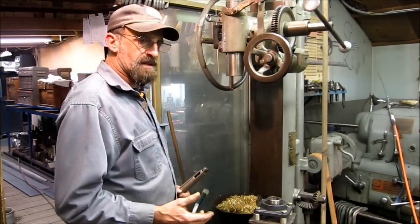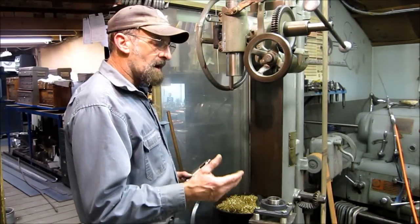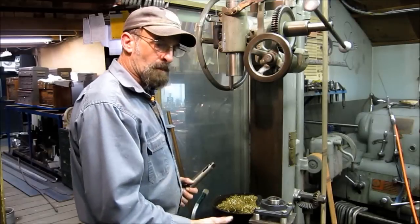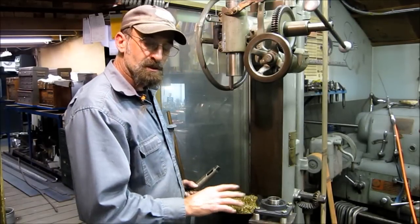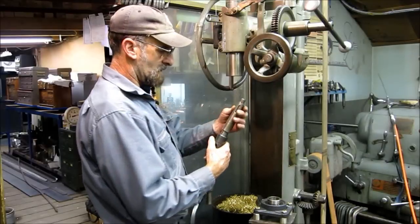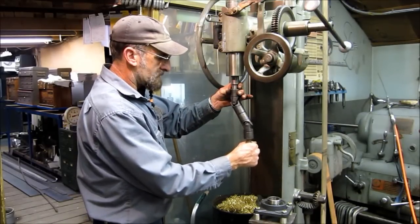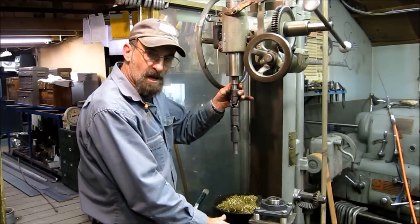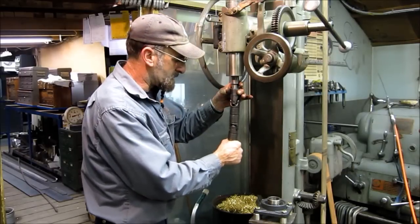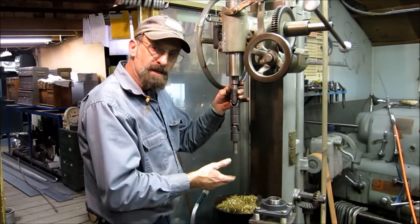In the pictures in the series of the line bore for the excavator, I line bored right here on the drill press. The main mast extension came in with a solid bore — I just had it blocked on the floor, not anchored down. So it was totally independent. I brought it in, eyeballed it, and with the Morse taper here I was able to locate it. Then with two series of ball joints I was able to let this run in line with the bore and the spindle run by itself without causing any binding or force. That's how I connected and handled the rotation and feed rate all with the drill press.